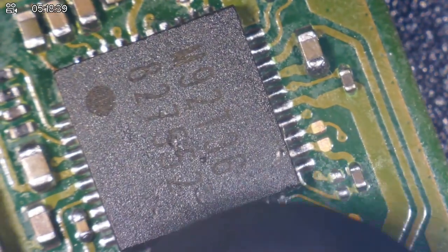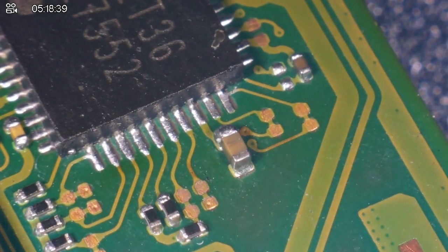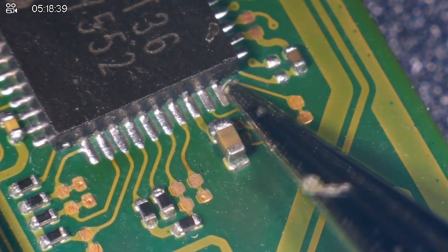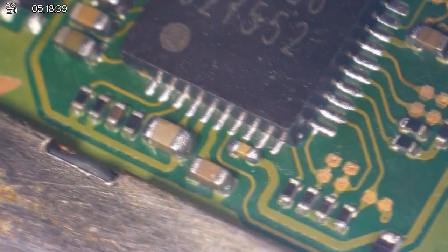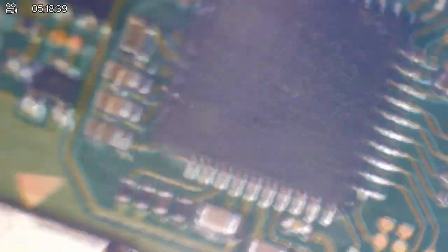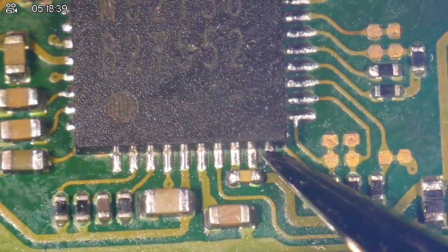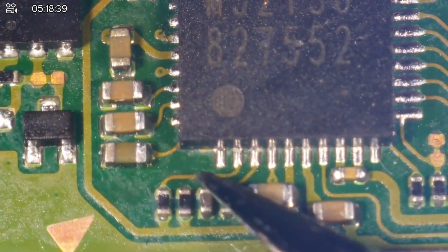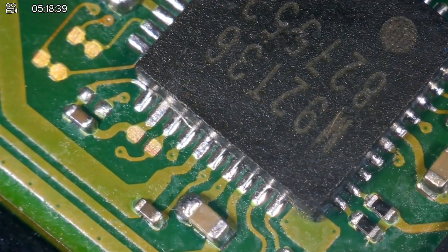This chip here is the one I was originally talking about when we get a flicker. I'm just going to first check that they've soldered this chip correctly, because somebody's definitely been in here. Down here there doesn't seem to be a great connection between this pad and the chip — that doesn't look so great. That's not on properly. You've got what looks to be an overhang on this side compared to here, and there's a pad that doesn't have anything attached to it — no solder or anything. That side's not too bad, but this side just seems a bit wonky. I think there's enough solder on those joints though — it just needs to be redone.